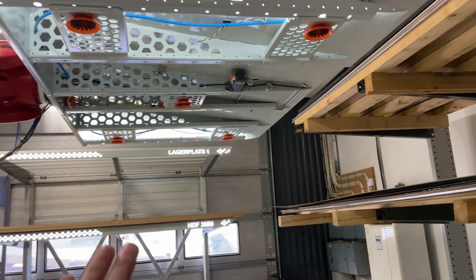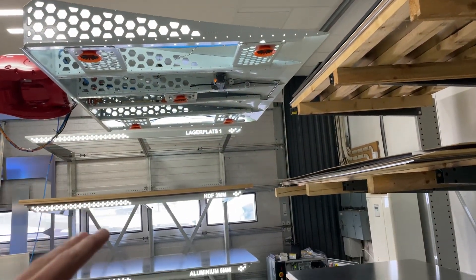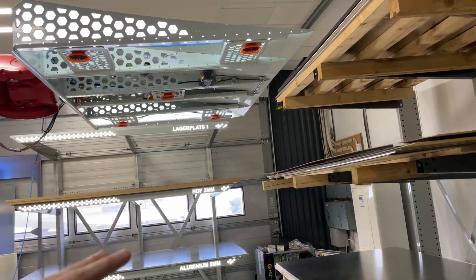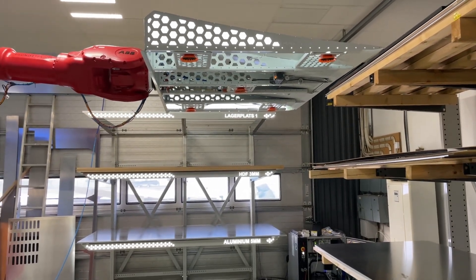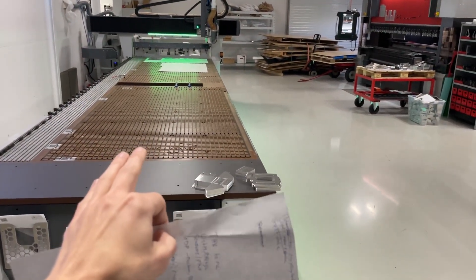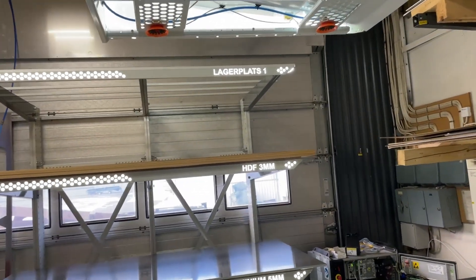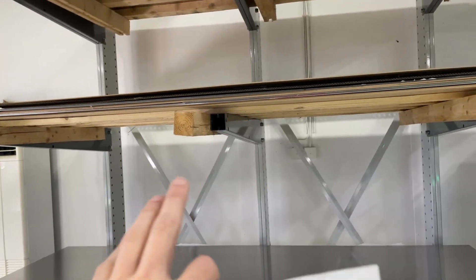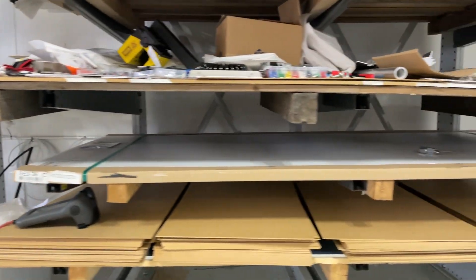Belt drive — yeah! One of the last situations where I wasn't in perfect control of the sheet with parts on it was when tilting it off. Since the weight and distribution decides when it starts sliding, that's going to be different for each sheet. So I always had to exaggerate the tilting action to be sure it's off, and that means you're not as gentle as you want to be. Besides, I realized I don't want to cut five sheets for one customer, then five for another, and have the sheets I want to access at the bottom. I've also been having this issue with pallets — you think they're standard, but they vary and they're always interfering with the arms.